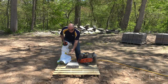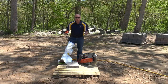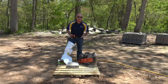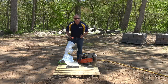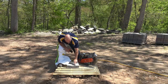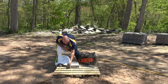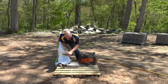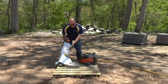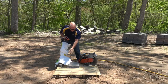So when I'm cutting the product, a lot of contractors ask, how do you keep that saw straight? And this is something you learn over time. Obviously, I've been at it 37 years in the hardscape industry, so it becomes a little bit more natural. But just some tips you can do. You can use a speed square, hold it on your edge and give yourself a vertical line down the front. That way you can run and do that front piece and then kind of work your way back. That way you're assured that you're gonna have a nice vertical cut right there at that point.